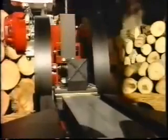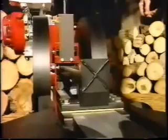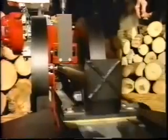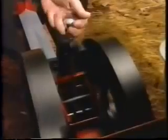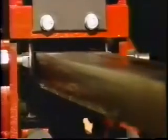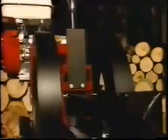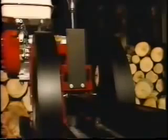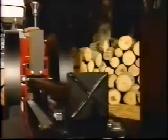The key to Super Split's speed and productivity is the patented and proven rack and pinion flywheel-driven mechanism at its heart. When activated by pulling up on the on/off knob, a cam lock device rotates and pushes the rack gear onto the revolving pinion gear, which is secured to two 72 or 100-pound flywheels moving at 300 RPMs. The rack gear, now fully engaged, moves forward and splits the log.